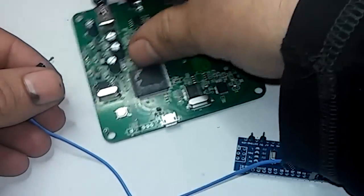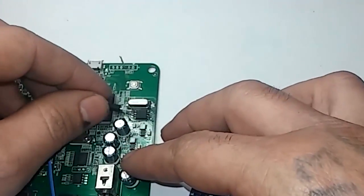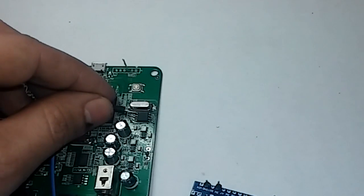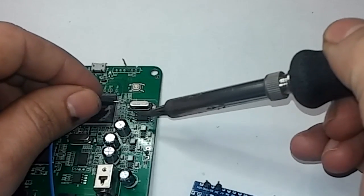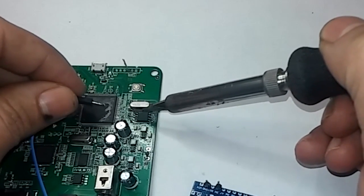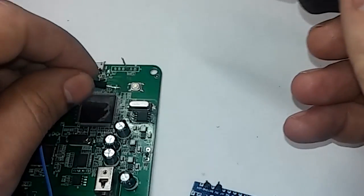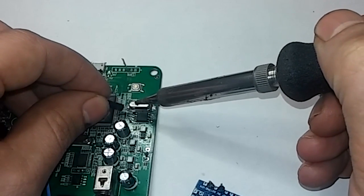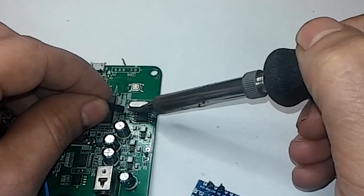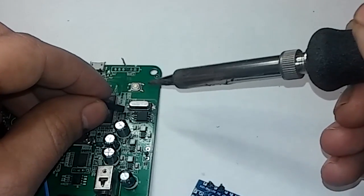So you can skip ahead here if you don't want to watch me soldering these. So I'm just going to turn the board here so it's easier to get to it. You'll probably want to pre-tin these too. Ideally, if you're going to continue always programming these or hacking these, I would just make a breakout over here somewhere with pins, so you can just plug it right in instead of doing it this way, because I did burn a trace off, but I was lifting up the pin. And if you're going to be moving it around a lot, maybe get creative with some hot glue or something.